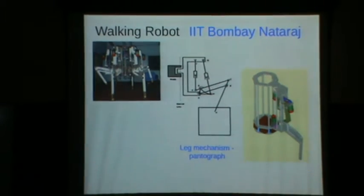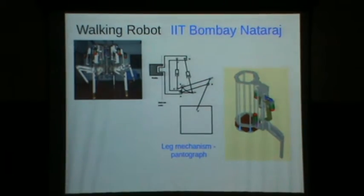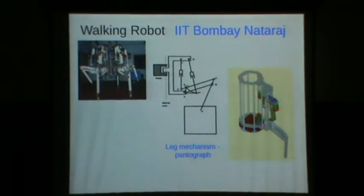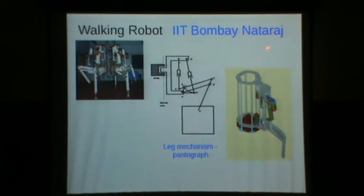So the biggest advantage of that is a significant reduction in speed and increase of force. Okay, and that is the biggest advantage. You also provide stiffness then, because it will be a worm gear without back drivability? Yeah, actually in this case it is back drivable. Okay. So it is a ball and nut. It is a ball screw kind of a joint here, kind of a system here. So this is back drivable. So a disadvantage with that is that it has to apply force all the time to stay there. But the advantage is that you can have force feedback. So that if you measure the current, that can give you a sense of what the forces are.